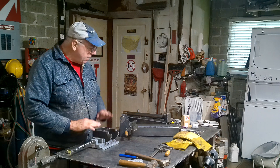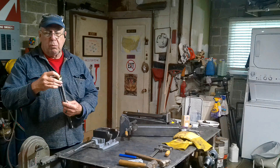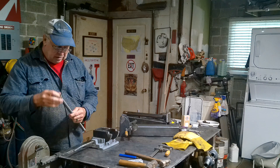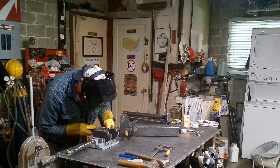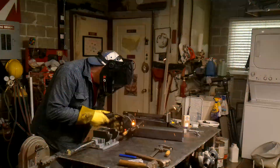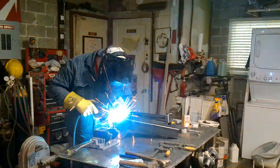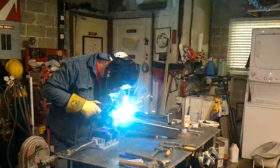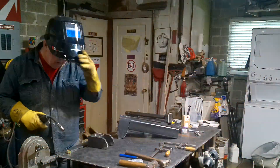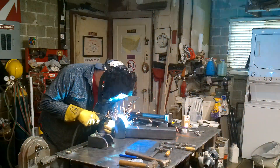Here we are clamped up with our jaw stanchions in place — they're aligned, they're square, and they're ready to weld. We'll begin by laying down some really generous tacks around the perimeter at all the joints, then come back and weld those solid. This is only a total of about 48 linear inches of welding, but it took a good 45 minutes because of the thickness of the metal and those big bevels. I had to use the zigzag weave technique to fill up the weld gaps.